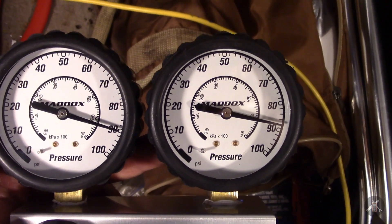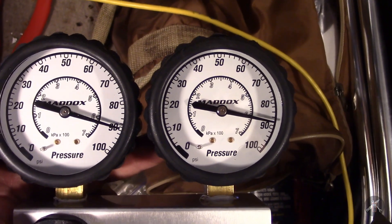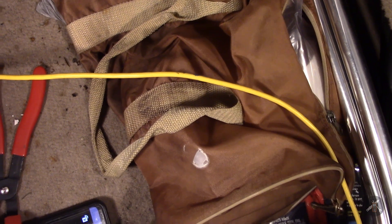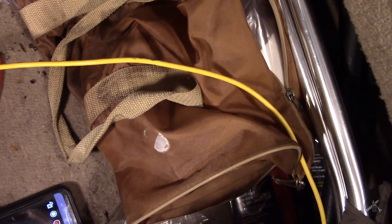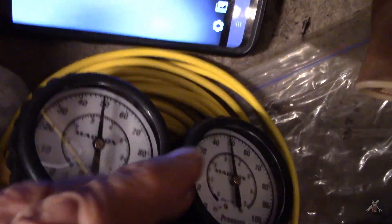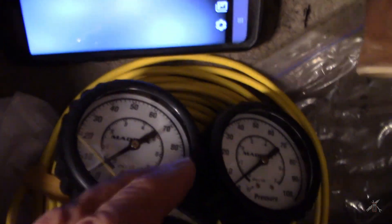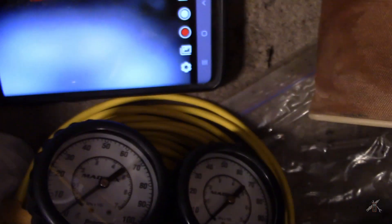You've got some gaps in the rings — you're always going to have a little leakage. That looks good. So now I'm going to dial up the next cylinder in the firing order, which I think is eight. We'll dial this down now and take a little pressure off it. If you had a huge leak, that would possibly mean you don't have it on compression. I have the hose threaded in to the spark plug opening, so I'm going to unthread that one, crank the engine over to the next cylinder, and try the next.